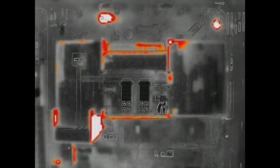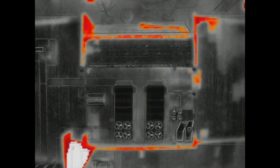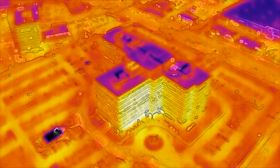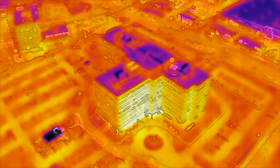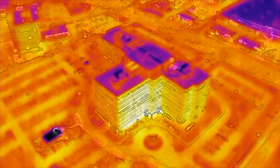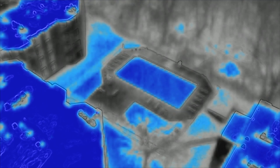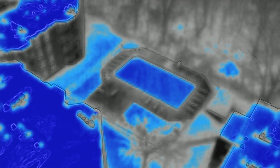For my case scenario, when I'm doing roof inspections, I've found that Hotspot suits me well because you are really looking for the areas showing the hottest temperature — this is usually where the underlying water damage is located. For firefighting operations, you might want to use hot metal, as I've seen depicted on DJI's website. Unfortunately, I wasn't able to use this drone at a fire scene. Cold spot has actually personally been helpful for me when inspecting cranberry bogs — it shows clients the cold spots and overall climactic condition of their water to ensure their crops grow properly.